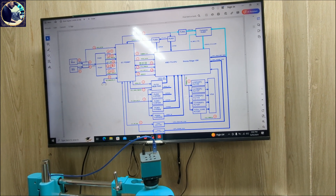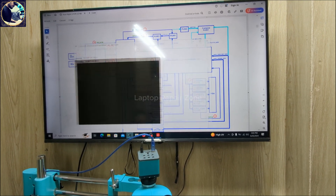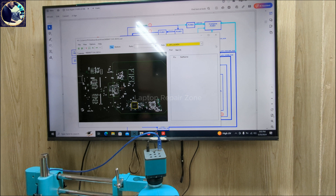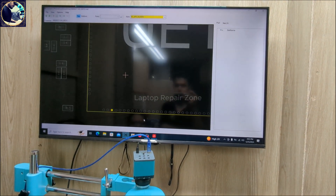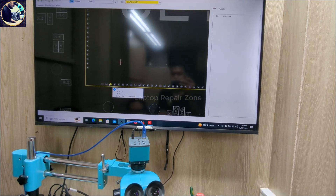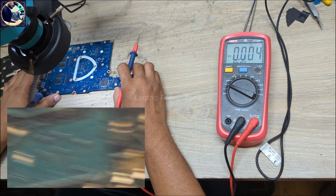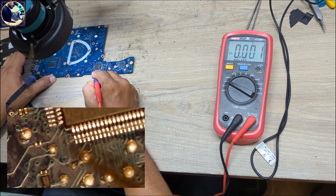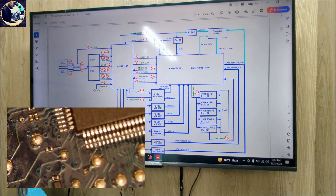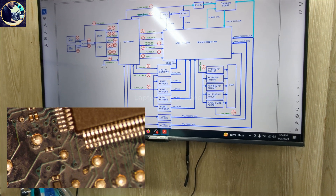At first I will check this one — let's copy and paste it here and check. This is an I/O controller, pin number 35. Let's check. One, two, three — we have 3.2 volt, it's okay, present. Then we need to check pin number two: 0.9.